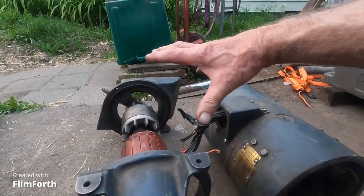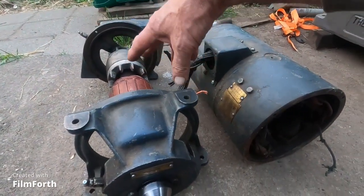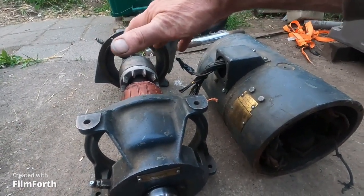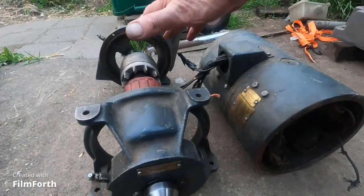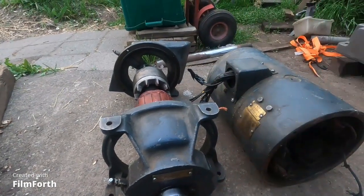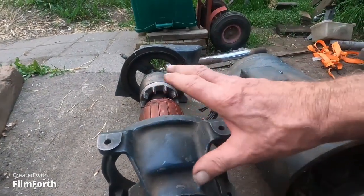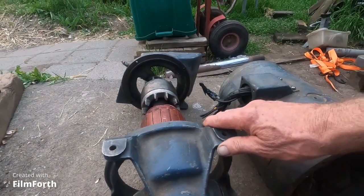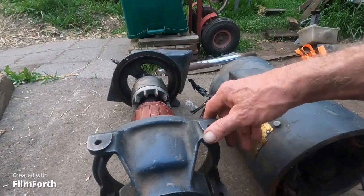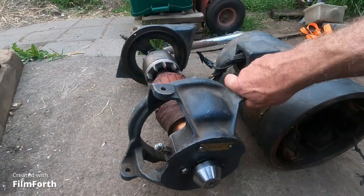I couldn't find the correct exciter for this at one time. I managed to adapt an early exciter that didn't put out enough voltage. I looked in one of their old manuals and it showed a larger pulley, so I tried that, sped up the early exciter, and it worked. Eventually I found the correct exciter from another guy who needed the one I had — it worked out. There tend to be more motor generators than exciters.